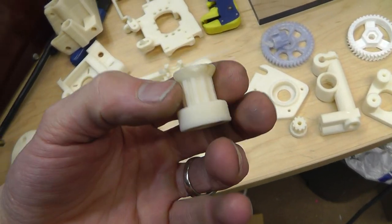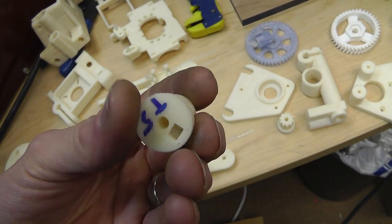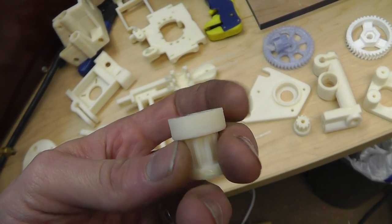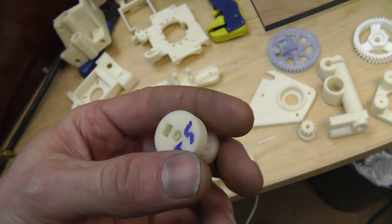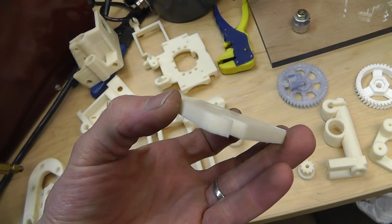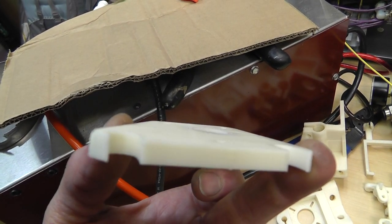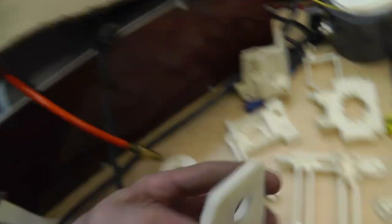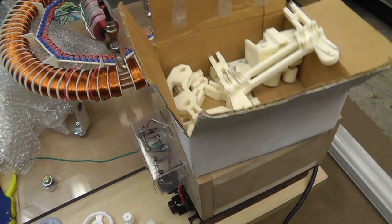They've been doing some cool stuff on this printer — worked out a lot of bugs. Jeff has cast and milled his own hot plate so he can print on a hot surface, so the plastic cools all at the same temperature. Otherwise it kind of wants to curl. After seeing Nate's and Jeff's prints, Nate, you've got to get your hot bed working — these things are just flat, flat, flat. It's all due to that heated bed.